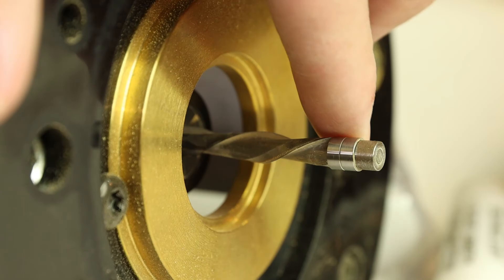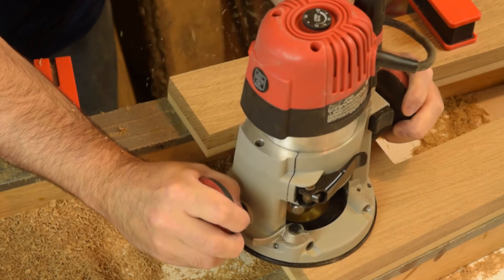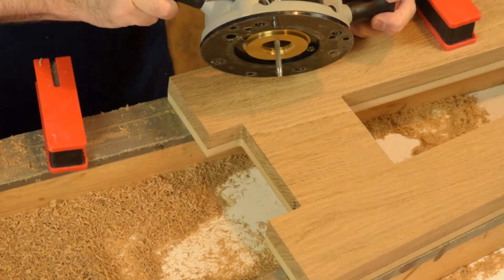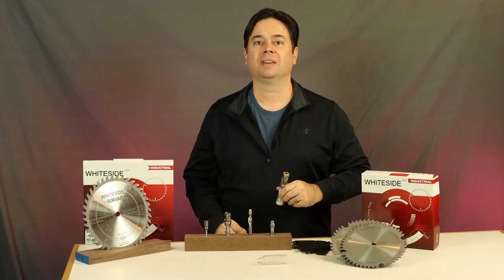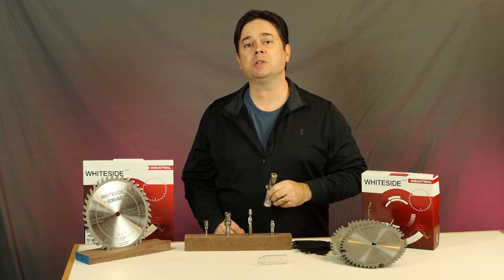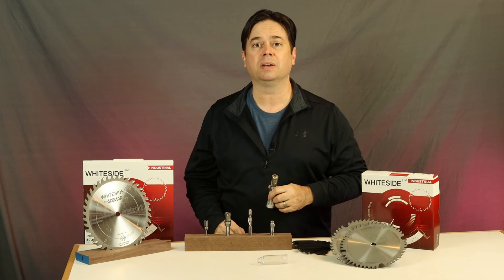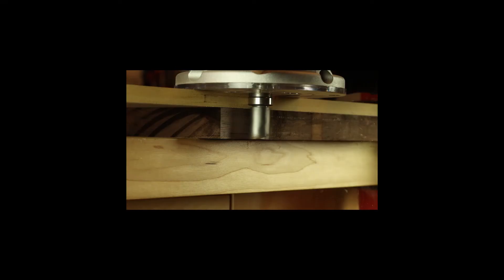There's also this small diameter carbide bit with bearing on the tip that I use quite often. Sometimes I'll use it as part of a two or three step process to cut out openings in furniture projects — usually I'll start with a larger diameter bit and then finish up with this small diameter bit to get into a tighter radius corner. We'll link up in the description box all the products featured in today's video. That's the roundup on all my favorite router bits, including Whiteside's ultimate flush trim series. Also look for my reviews on Whiteside plus industrial saw blades and dado blades. Thanks for watching.